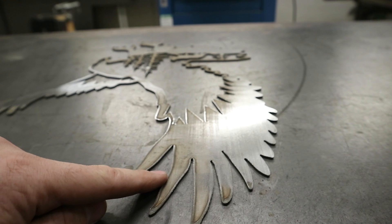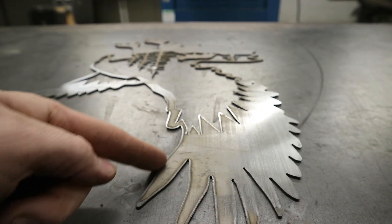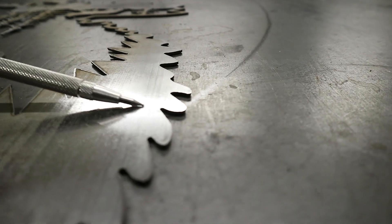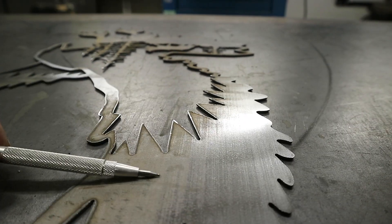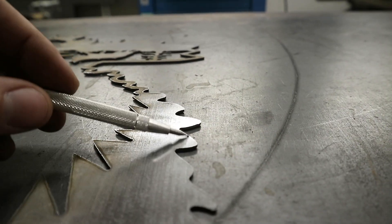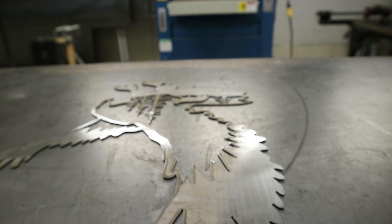All right, let's go ahead and take a look at this Eagle. I ran this thing through that dual sander probably 10 times, which took me about 15 minutes. Now, if I were to use the Milwaukee die grinder, I probably would have had about the same amount of time into it. And even after using the dual sander, I still have to go back with the die grinder and hit the edges. That sander gets 90% of the dross — it knocks it way down, almost where it's completely flush. But you can see in some sections it's completely sanded down, and right next to it it hasn't been touched at all by the sander. So it can be very inconsistent when I run a piece through. Sometimes it hits it, sometimes it doesn't. I'm not sure why that happens, but I still have to go through and hit all these edges. This thing does save some time — if I was running a lot of cuts through, I may use it, but most of the time I don't.